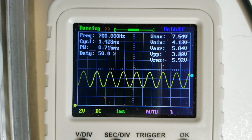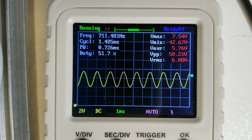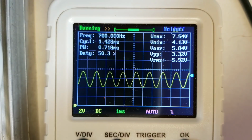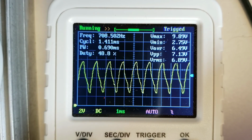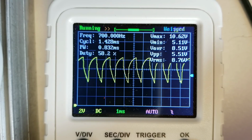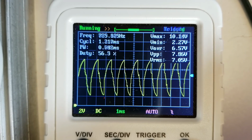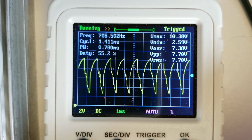Now here I am with the earphones plugged in. I'm using an old pair of mobile phone earphones from an old BlackBerry mobile. Now I have the gain setting very low, but you'll see what happens as I turn it up. The signal starts to get very, very distorted, and if I turn it to maximum, you're seriously starting to overload the op-amp output, so it gets extremely distorted.